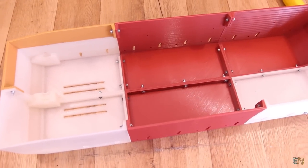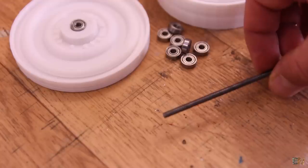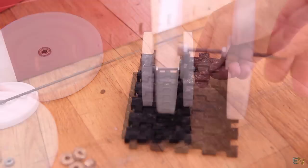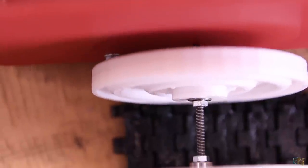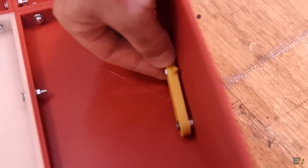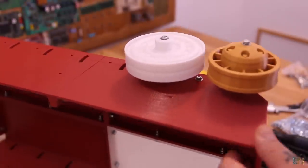Now we should add all the wheels, but first we need to add the bearings. I'm using some small 11mm diameter bearings — one on each side of each wheel. Next we need a long screw or a threaded rod cut to size — for this I cut a 10cm screw. Place the wheels so they fit okay on top of the tracks: the two types of thin wheels and then the thick wheel in the middle. Also make sure you have some clearance from the tank case so the tracks won't touch it. At this point I realized the suspension 3D printed part must be a lot thicker and with a bearing on each side, because with only one bearing the part moves too much. This part is too thin and won't support the entire weight of the final tank without wobbling, so I won't be able to finish the track system today and will improve the design for next week.